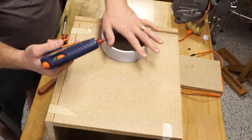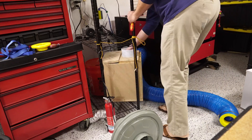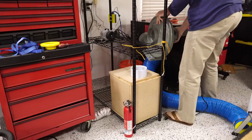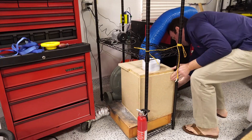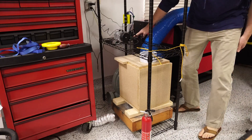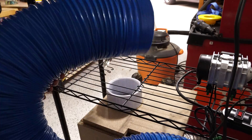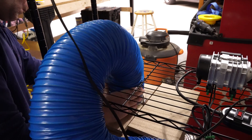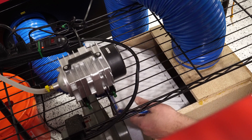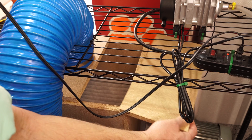There's the top and the bottom where it sucks out all the fumes and hopefully makes my shop environment nice and clean. I put it on my rack. Then there's the blower that'll suck it out. I had to lift this up a little bit with some stuff I had lying around the garage. I got it pretty close, so all I had to do was use duct tape to attach that to the fume extractor. Another cut with a Dremel tool got the extraction hose in. Locked it down with the hose clamp. You get the HVAC filter and a magnetic attachment for the exit chute, then duct tape for the output. Seems to seal pretty well.